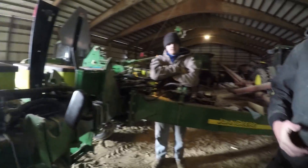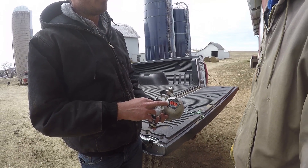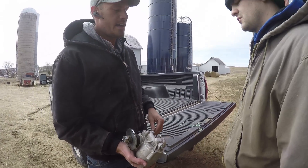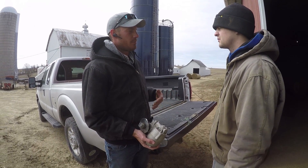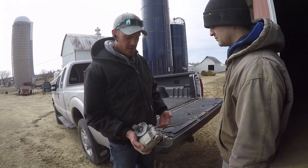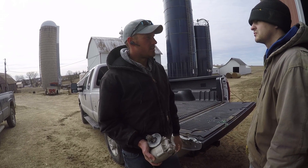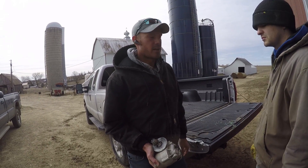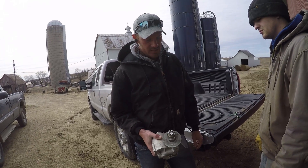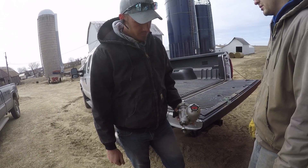The other thing I wanted to show you — I did grab one of those hydraulic actuators so you can see it. It's in the truck. We'll have one of these hydraulic actuators in place of where the airbags are on every row unit. You're going to have hydraulic flow in and out from your valve box. I'm putting a two-channel valve box on here, so you're going to have the center section of the planter able to independently operate versus the wings. Because you're probably going to have more compaction behind the tractor, you'll be able to change your downforce in the center and then the wings. There are several row-by-row systems out there, but there have been so many orders for this system that they're backordered past April 1st. So that's why we're going to go with a two-channel system this year. We use the existing bracket that the airbags are on — pretty easy install. This is the anti-rotation that sits in the back; it just sits on the planter right like that. So that's simpler than I thought it was going to be.